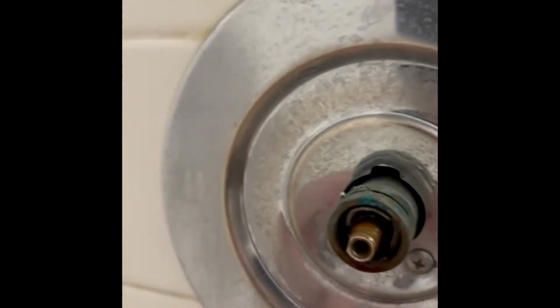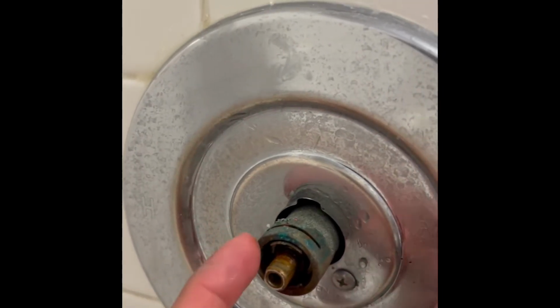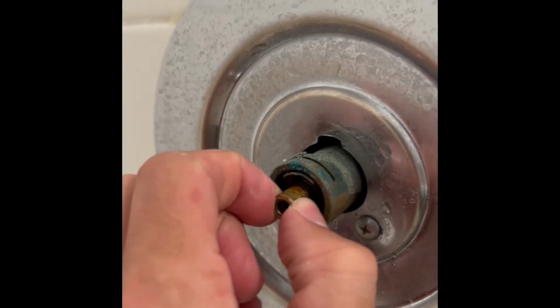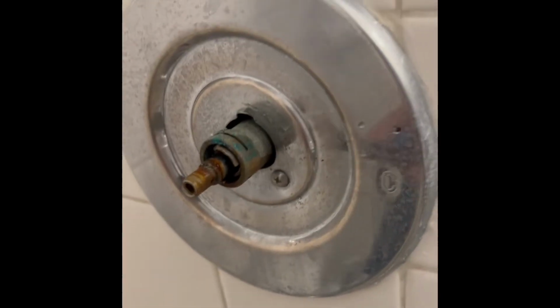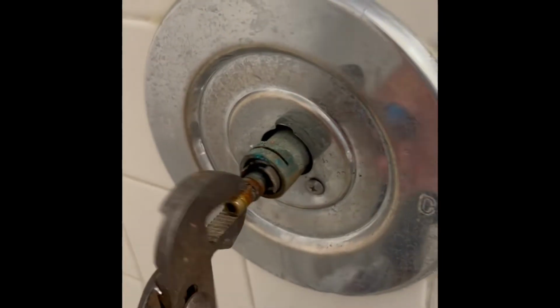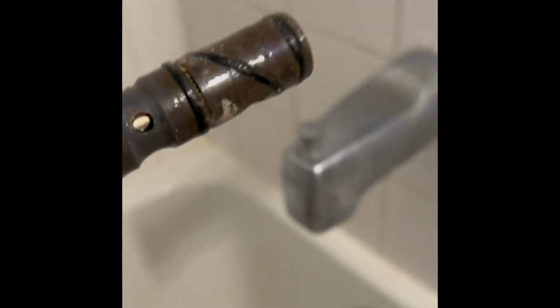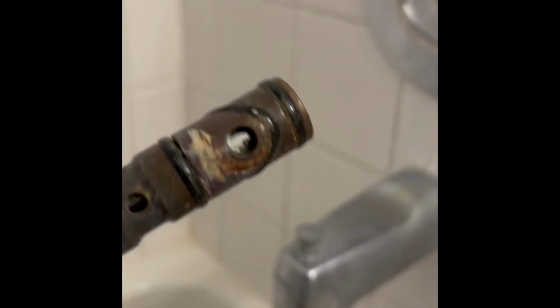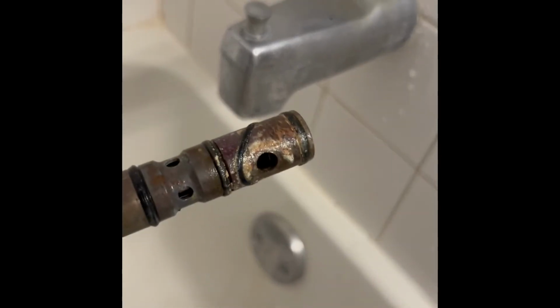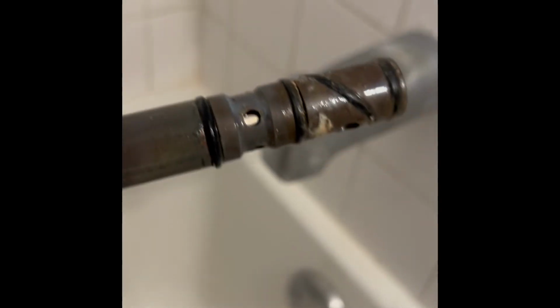And now, this cartridge is gonna pull out of here, but there's likely corrosion back there, so it's gonna be kind of tough. But I'm just gonna pinch this with my channel locks and pull it out. As you can see, there's obviously some corrosion and there's just all kinds of crud on there. The rubber gasket that wraps around it is the part that keeps it from leaking water. And as you can see, it's pretty gummed up and worn down.